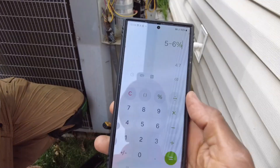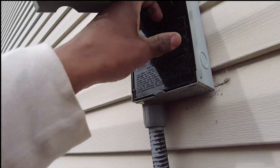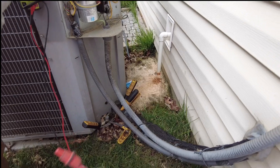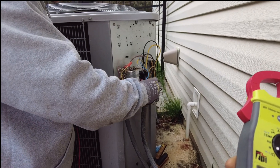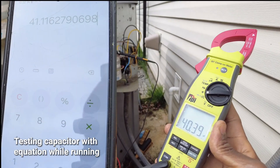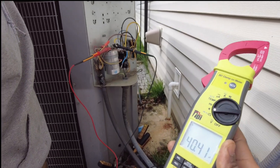Let's stop and verify. We're going to bust the disconnect and pull it out. Now let's see if this is accurate — let's actually test the capacitor. Another tip: if you're by yourself, take a picture of the wiring first before disconnecting anything. So look — the meter reads 40 microfarads. We measured about 41 — it's showing 40.4. That's accurate.